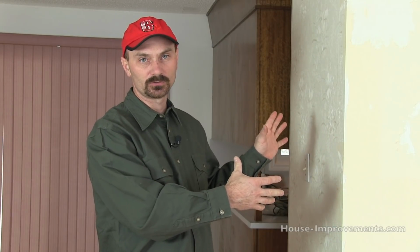So just have a good look at what you've got. I know it's hard to tell anything when you still have the drywall up, especially on a wall. But do as much investigating ahead of time as you can, asking people questions, that sort of thing. Look around in the attic, look under the floor, all those sorts of things, to look for any signs that are telling you that it is load bearing and not just a decorative wall purposely put there to just divide rooms off.